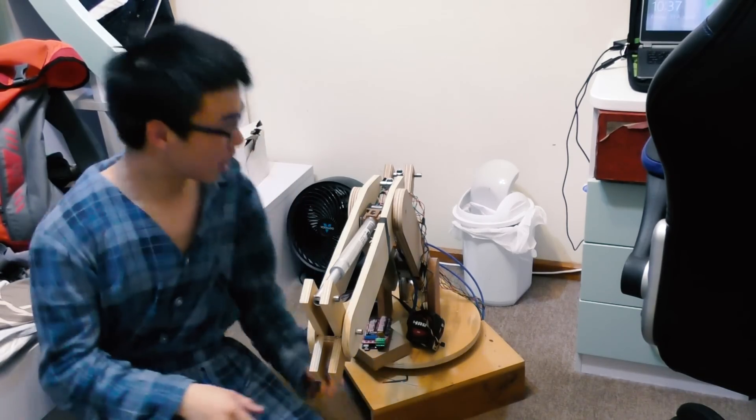We are back now - very long story. We are in my room, removed from the workshop, and this is about 10:30 at night - look at the dedication. Personal engagement - I'm in pyjamas. Don't panic, I'm not gonna die. I'm speaking so quietly because my family's asleep, so this is also a good opportunity to test my mic. Bit of drama happened - you know how we had the 24 volt power supply? Luckily I didn't plug that into the Arduino yet, because that would have blown it up. Even though the stepper motors could take the 24 volts, the Arduino can't - so don't do it guys. Because of that I went out and bought another one, got the correct one - 12 volts. Tonight's goal is to get this thing moving.